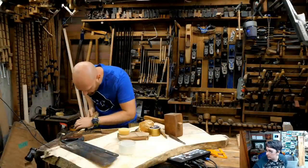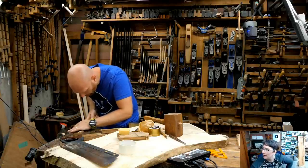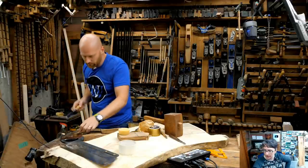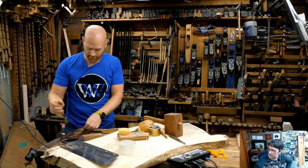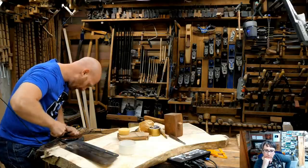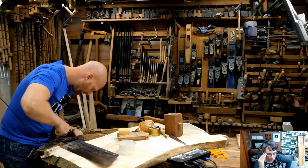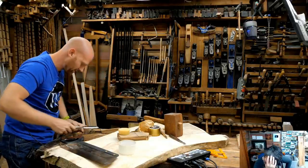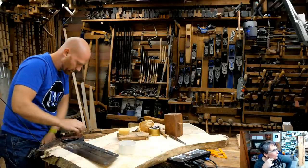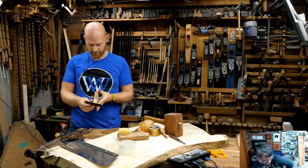Yeah, hang on. One just popped. Porman asked, what happens if you put the grain on your bow tie in the same direction as the grain on the workpiece? Then the bow tie is perfectly worthless because there's no strength across the grain. So if you have the grain going across the bow tie, then you have nothing holding the bow tie together at the waist. May look good, but it's not useful.